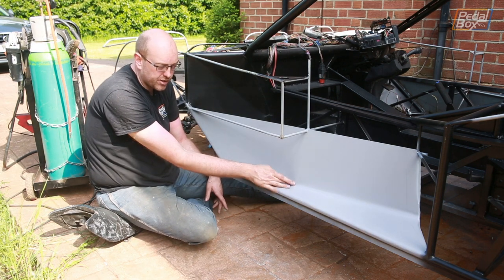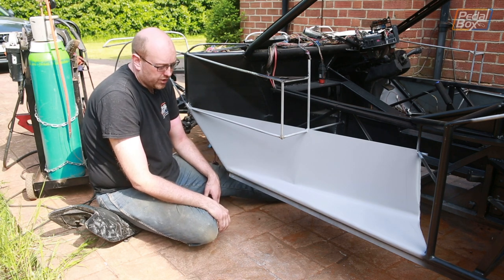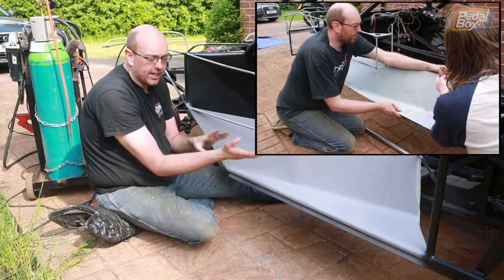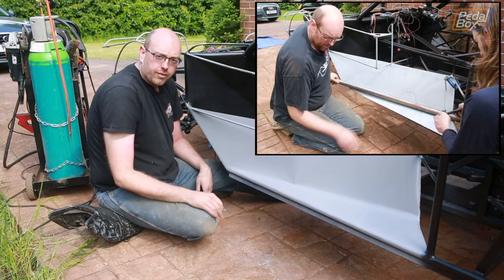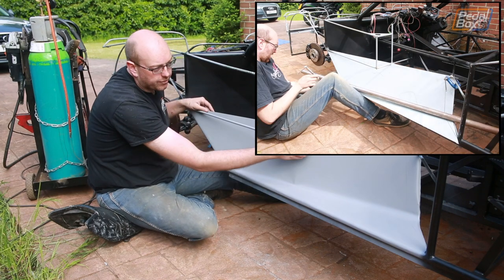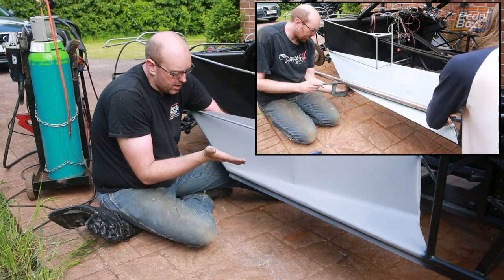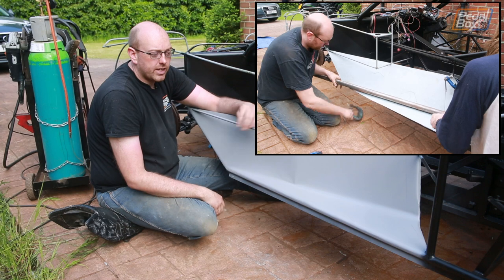As you can see there's a little crease in here that we're just not going to be able to get rid of easily, so that's one for way down the line. The initial bend we put in with a piece of 40mm pipe and just rolled it over that to get the rough shape and the rough angle between the upright and flat across the bottom. After folding that round we ended up notching it around the framework at the intercooler end, slid it in and then started forcing it into place, clamping across the back and pinning it with some inch tube to get this bend right the way down inside.